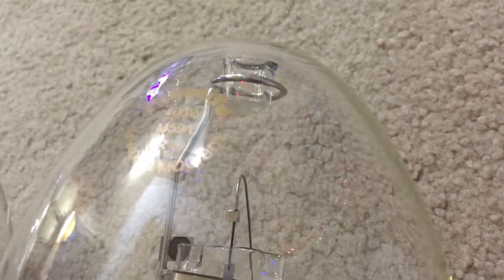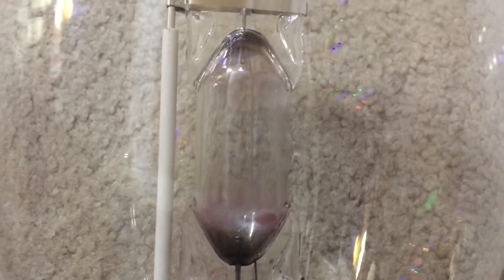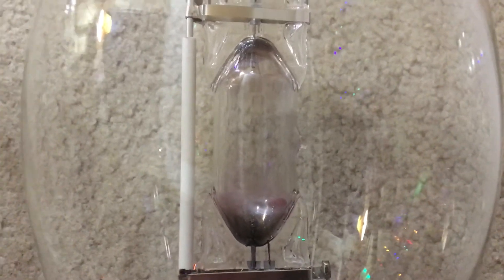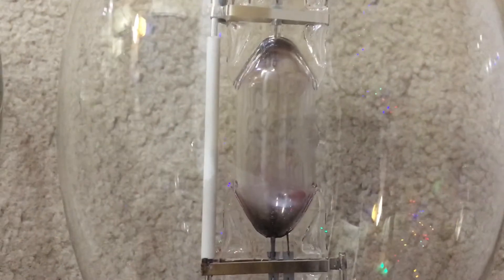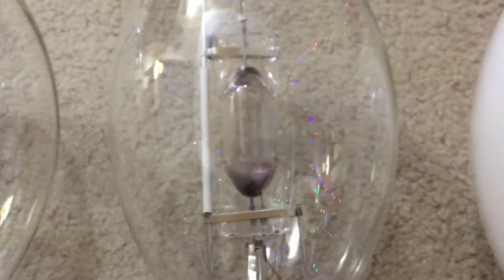The BDX tells me it's a blue deluxe metal halide lamp. The halide salt in this arc tube is indium only — just indium (In). You can see the halide salts appear violet, which reminds me of an aquarium metal halide lamp since it uses similar elements, although aquarium metal halide lamps use indium iodide. This is my favorite colored metal halide lamp of all time.